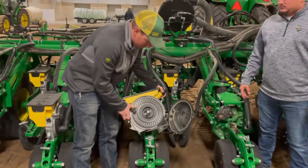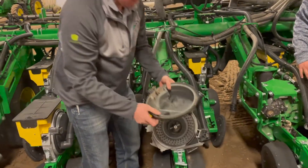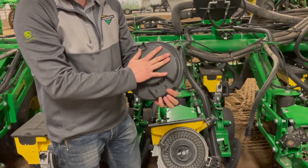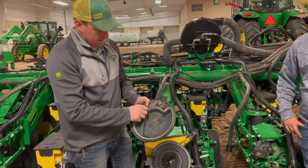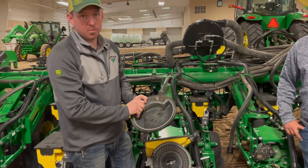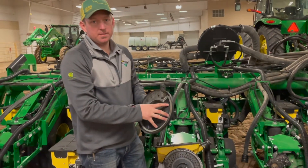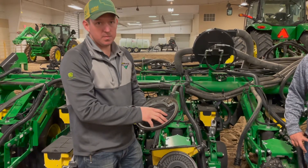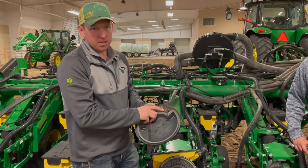I've got this meter disassembled and you can see some of the first things you might want to check before you get started in the season — our door here. You might want to check for cracks or any other defects in the door. As you turn it over and see the inside, you can see the seal here. Run your finger across that, make sure it's not brittle and make sure there's no cracks in there. If there's any damage, you're going to see a variance in your vacuum on that row and section, and it's going to affect your population and your seed spacing.